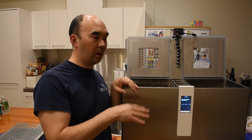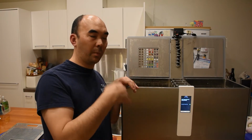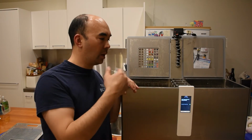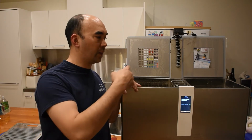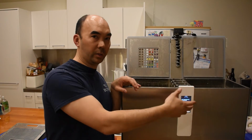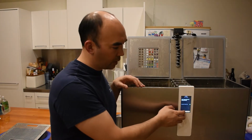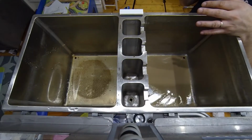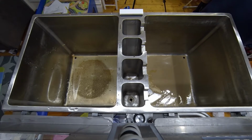It then takes that and runs that through the hop cages, recirculating it around together with the washing tablets that does the majority of the cleaning cycle. After it's finished that, it then takes that water and pumps it back over to the mash tank to clean that side of it. So now we're ready to go. We'll start the cleaning process and the first thing it'll do is start the water in there.